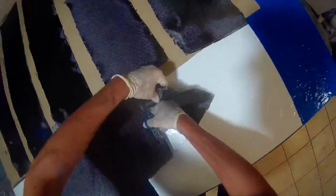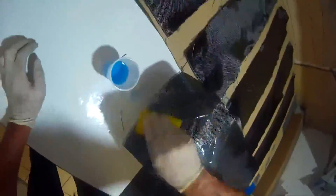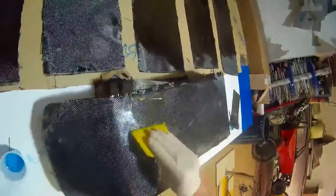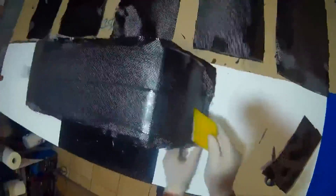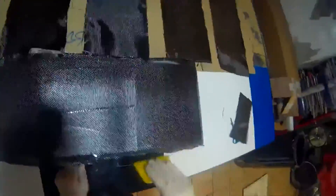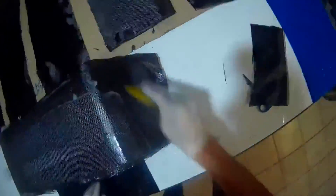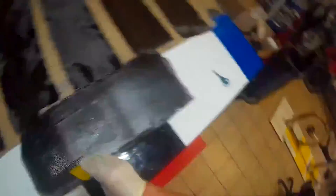Once you have made the mold — the mold is just this sheet of steel — I use some very high grit sandpaper to make it as smooth as you can. As it is very smooth, you can take the carbon away very easily, but you can also use some release agent to make this part of the work easier.